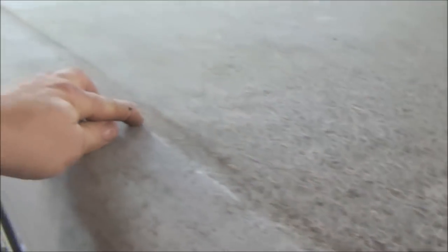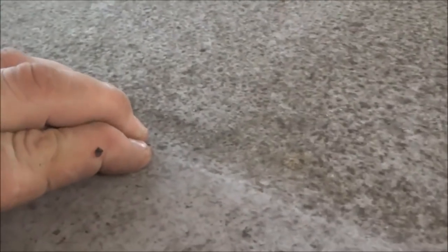Most of this doesn't look too badly breached in here, but you can see it's really stretching across this area right here all the way down — you can actually see the line. That tells me this is not secured down right. You can see this flex right here — it's just going to tear the roofing. And it's absolutely filthy to boot right here.